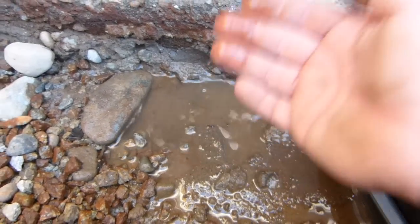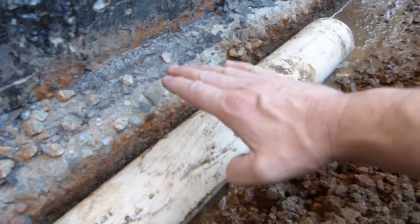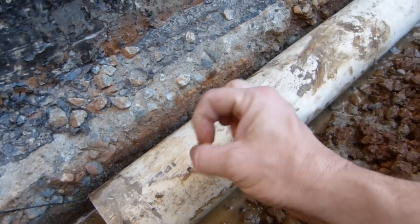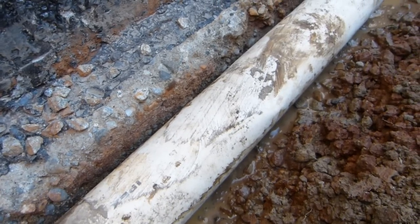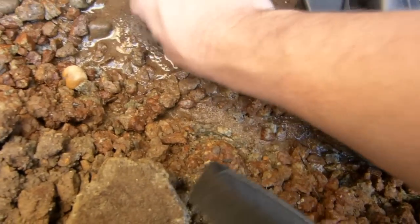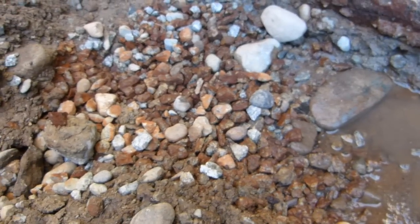The reason for the crushed gravel is so that it doesn't get clogged up with sediment and sand. Because if the groundwater moves outside of the pipe, within the backfill against the footing and the foundation wall, and the groundwater rises to this height and is moving inside the backfill, but the little holes and perforations are all clogged up in your perimeter drain, then the perimeter drain is not functioning and not doing anything. So to prevent it from clogging up with fine sediment, silt, and sand, it should be all encased in drain rock.